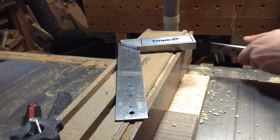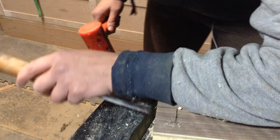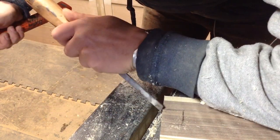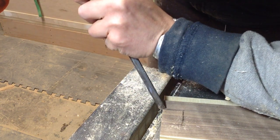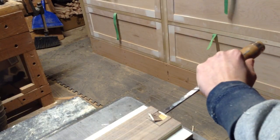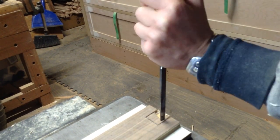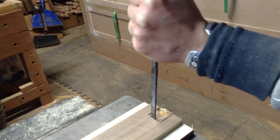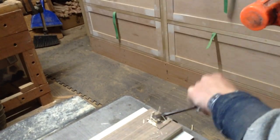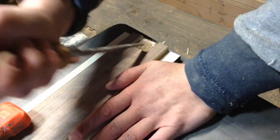There's a little rubber flange on the linear actuator that was hitting the inside of the front plate, so I made an oversized mark and removed about a quarter inch of material off the inside. Since I was building this as I went, it's just easier to remove some material. That clearance on the back side means it fits in there nicely now.